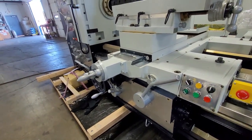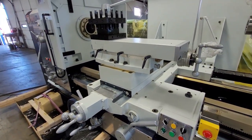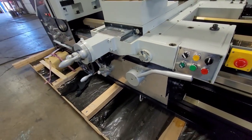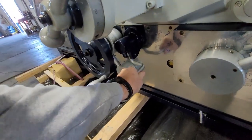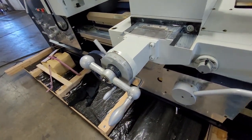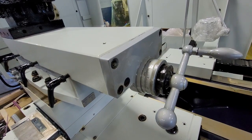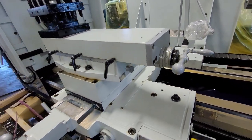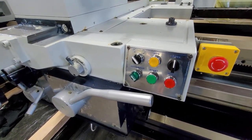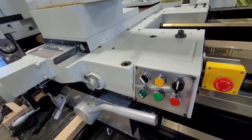A very nice feature of these machines is a six-way power feed — that's the carriage, the cross slide, and the compound slide. We're still in that same power feed. You can see that's going to be running longitudinally. If you want to run the cross feed, now your cross feed is feeding. If you want to run the compound, now you can see your compound is feeding. You have the same controls on the apron as well, which can be very convenient for the operator. The stop also has the electromagnetic stop — stops it right now.